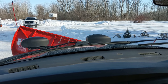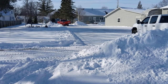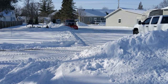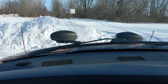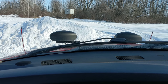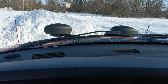So if there's more snow like we have here, I'm not going to grab a full blade width — I'm only going to take about half a blade width, which I'll show you next. As you can see, when I approach the snow pile, I let off the throttle of the vehicle and I let the weight of the plow with the snow in front of it start to slow me down. You never want to ram a snow pile — that's when you start breaking things or damaging curbs or landscape behind it.